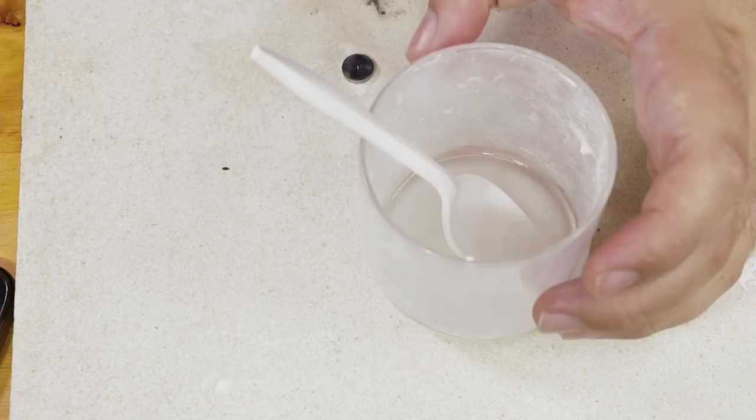So now the machining is finished to make the die, I need to harden and temper the tool. So the way I do that is I made this little container out of copper tubing, just like this stuff. So this not only helps hold the part, but the copper is a great conductor of heat and makes like a little oven in there, so the heat doesn't dissipate away and you can get a more even distribution of heat. So I'm going to heat up the die now to a cherry red, quench it in water. It is a water hardening carbon steel. And then I'm going to give it a quick polish and temper it to a light straw color.